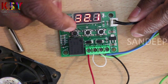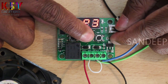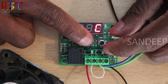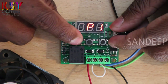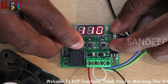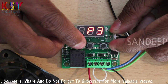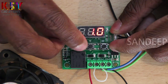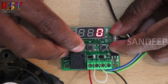Now we will see the settings part. The first menu is P0, the second menu is P1, and it goes on to P8. In the first menu P0, we will see C and H — that is cold and hot — I will keep it in cold. In P1, keep it at 0. In P2, set it as 110. In P3, it should be minus 39. In P4, set it as 0. In P5, set it as 0. In P6, leave it in off mode. In P7, set it as 0.